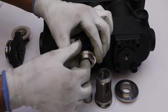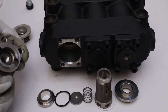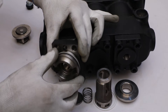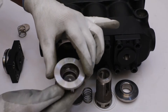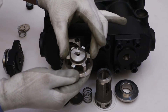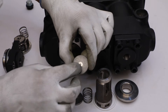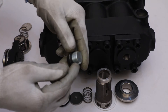Check the upper side, area, and groove surface of the valve holder for any type of damage. Check the flat surface, periphery, and inner surface of the discharge valve guide. Check the stiffness of the helical spring. Inspect both sides of the surface of the suction and discharge valve plate for any wear and dent marks. Check the thread of the solid plug for damage.